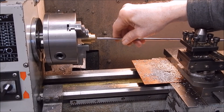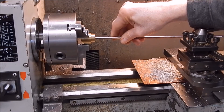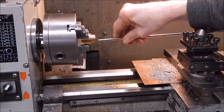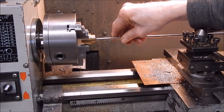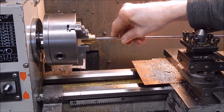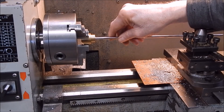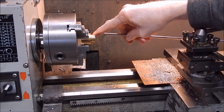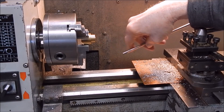So I'm going to try using the Hilda with a ball-head carbide burr in it. A ball head should basically work like a round nose cutter. I wouldn't try a cylindrical one because I think that would be asking for trouble. So I'll use a ball head, and with a bit of luck I can open this up so the shaft goes through. This will be the first time I've tried it on brass with a carbide burr like this, so you can come along for the ride and see if it works.